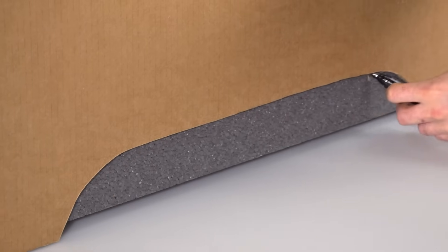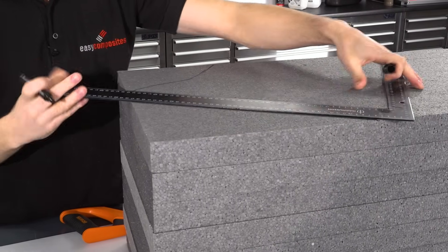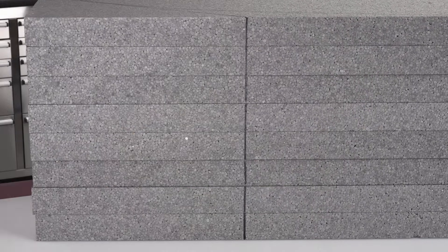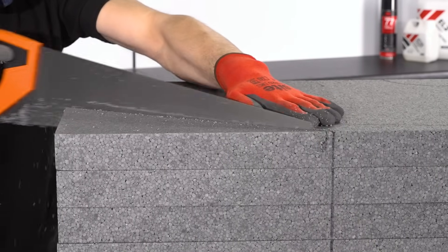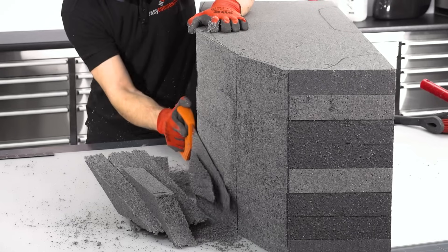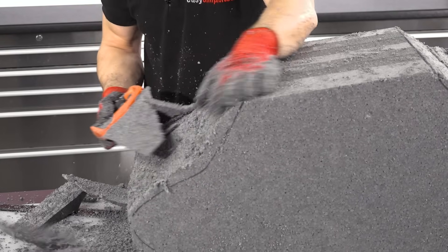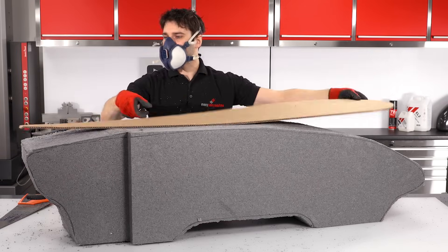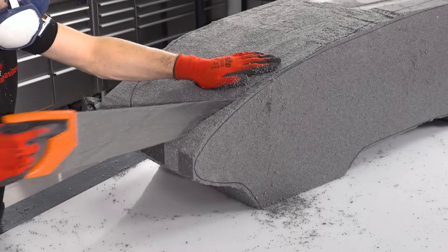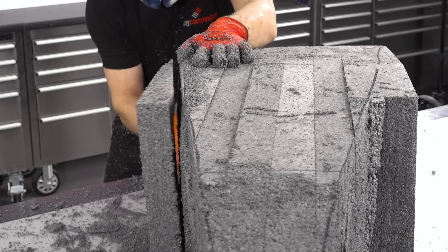You may be wondering why our foam is grey — I chose this as our local builders merchants had it and I thought it would show up better on camera, but otherwise it is exactly the same as the white foam that you would normally find. This foam cuts really quickly just using a handsaw. It will also hotwire cut very well; however, do remember that the hotwire will not cut through the adhesive. I also find that it leaves a hard skin on the surface, which can be a problem if you need to sand it. But for shapes without double curvature, like a straight or tapered airfoil, it might be a fast and clean tool to use if you have one.